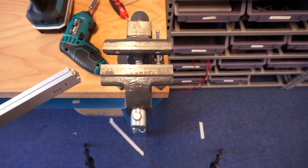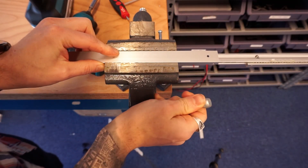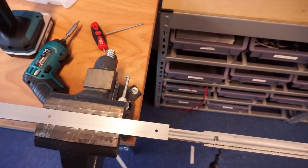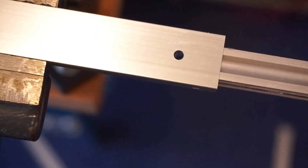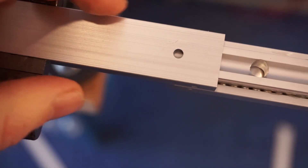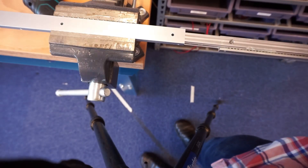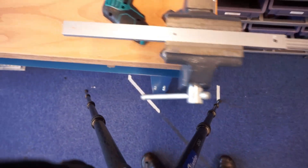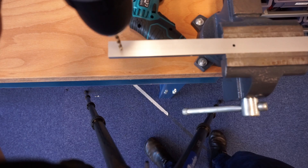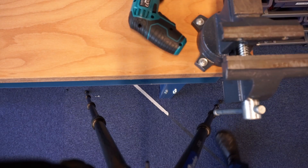Let's head on over to my vise. We're going to extend this out, give it a nice little clamp, making sure that we're going to get straight through on this hole. Make sure that when you drill through you're actually going to clear through and not lose half of your piece. So let's drill through with a 4.5mm hole. We'll do the same thing on the other side. Clear out any aluminum chips — now we've got our holes ready to rock. That 4.5mm bit is just enough so that when you have your hole there, you can still get your countersunk screw in that top end.